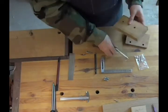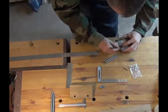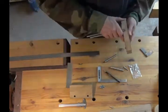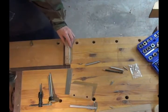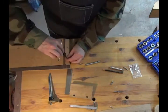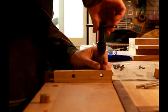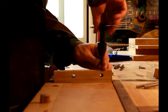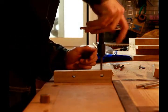The rods were a little bit tight, which is exactly what I wanted. Then after doing that, I squared the holes to the top of the body so that I could drill holes in the top for screws that would hold the guide rods in place. I thought about using inserts to hold the screws in place, but since I was using oak, I figured it would be easier just to tap the holes directly. I've done this before on oak and it works very well. The screws are not going to be taken out again after I put them in, so there's no problem with the threads degrading on the inside.